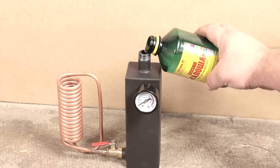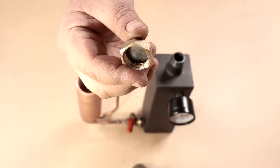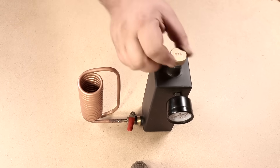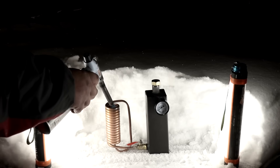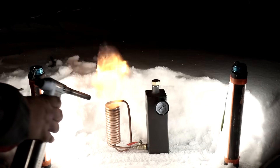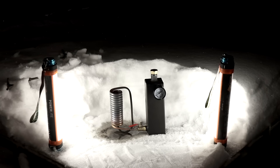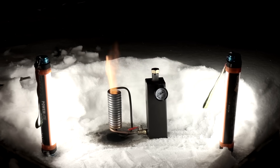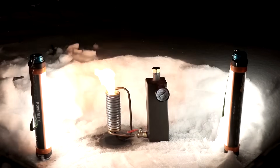Finishing the assembly and will test. I will test on refined gasoline. I wonder if it will work on oil and diesel fuel. Trials — it's minus 25 degrees Celsius outside. Quick start with preheat, but it doesn't work as planned. I don't give up. I went to the premises and replaced the nozzle. I also adjusted the position of the nozzle in relation to the center of the coil and the depth of location.